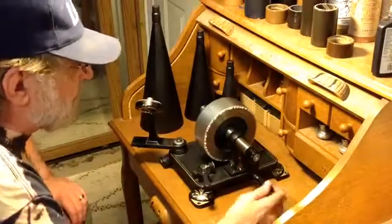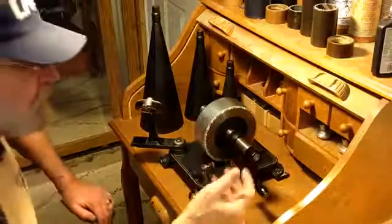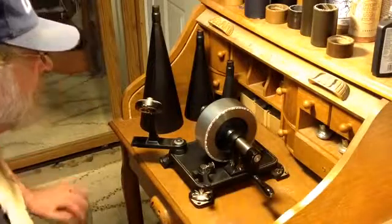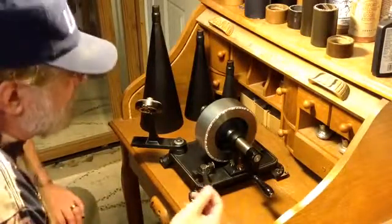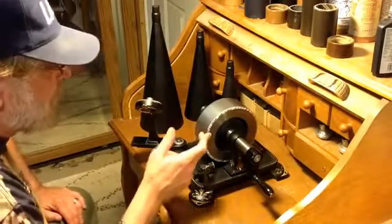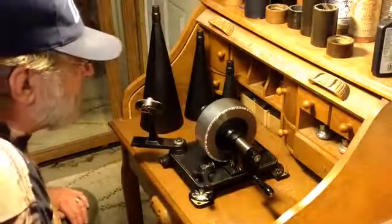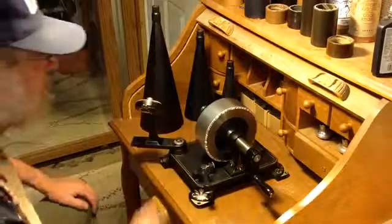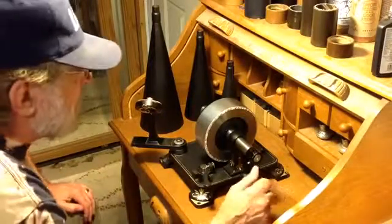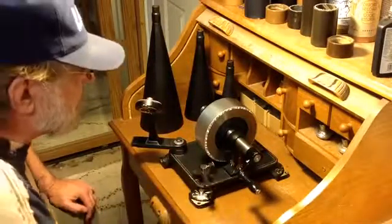There's so little information on recording on a tinfoil phonograph, especially recording on aluminum foil, that it's all trial and error. I mean, all of it. And it's adjustments, make a recording, adjustments, make a recording. And I've gone through 140 feet of aluminum foil cut into 2 1/8-inch strips. So I'm cutting these all out with a razor blade, so it's make 5 recordings, cut some more foil, make 5 recordings, cut some more foil.